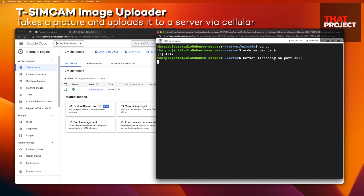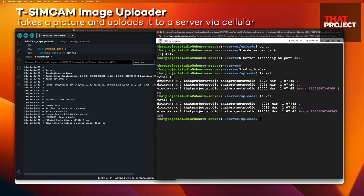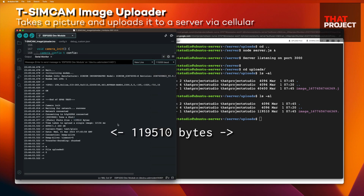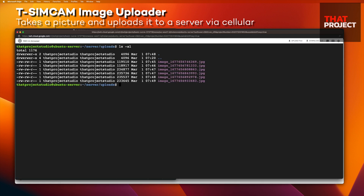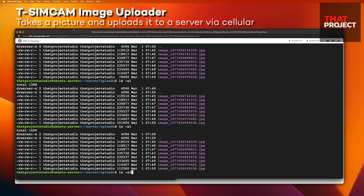Let me build and flash it to my device. Now the server is running. The device takes a picture after connecting to cellular and starts sending it right away. It seems it's currently being uploaded. Let's check if the file was created in the uploads folder. The image file has been sent — great. The sender's byte count and the receiver's byte count are the same. It took about 12 seconds to transfer about 120 kilobytes, which shows a slower transfer rate than expected.